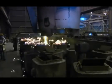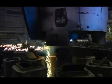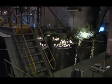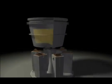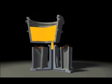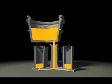At our Faircrest plant, steel is bottom poured into ingots. The ingot molds are arranged on an ingot car in a cluster around a central filling tube called the trumpet. A ladle is moved into position and the molten steel carefully flow controlled into the trumpet. The steel, protected from unwanted environmental gases by a shroud of argon gas, flows down the trumpet through runners at the bottom of the ingot cluster and fills the ingots from the bottom up.